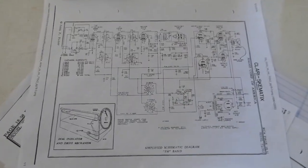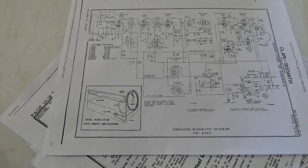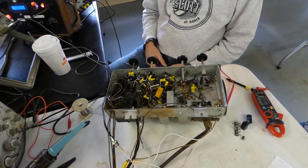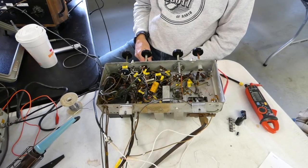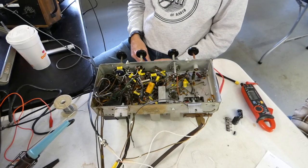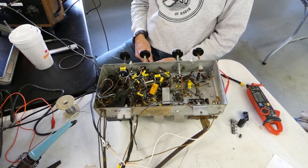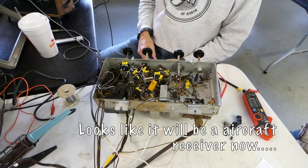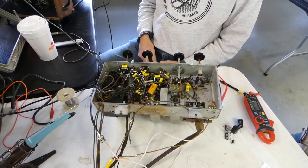Here's the schematic. I'm trying to remember what the frequency of the oscillator coil is on FM — 10.7 above. Right now at the bottom of the band, where the oscillator should be around 98-something, it's over 107. With the brass slug pulled all the way out, that's it — can't get it to go any farther.